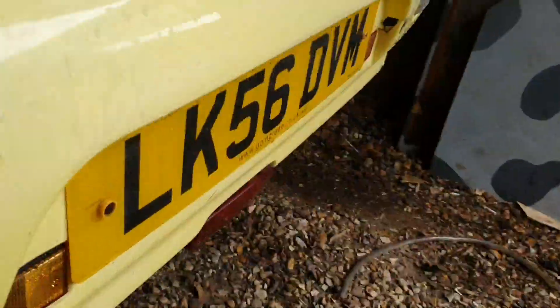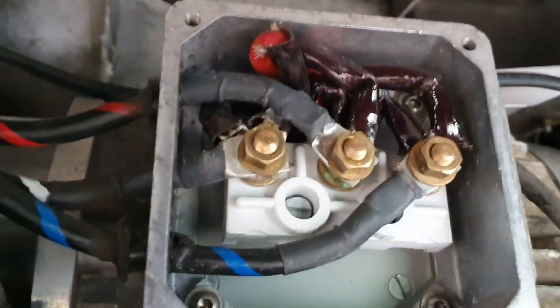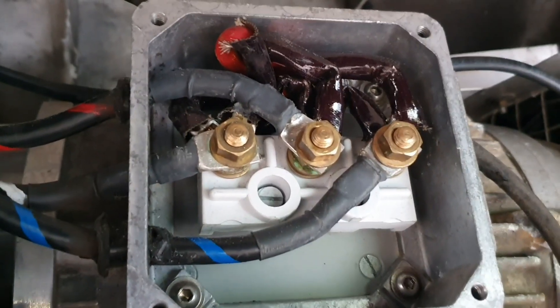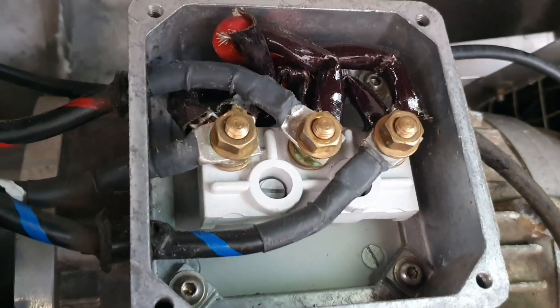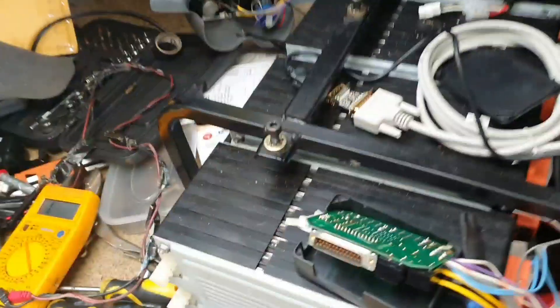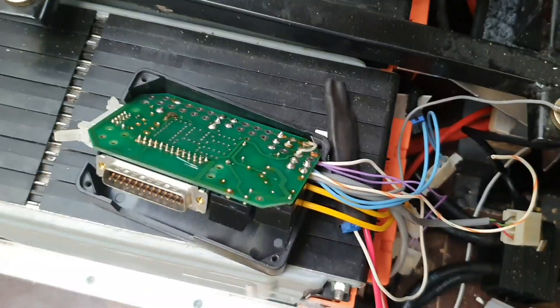The next step is coming around the back of the motor. You see where all these terminals are — the red little wires underneath. I've got to take one of each, check for continuity, and then connect those ones together separately onto a bolt. And what that will do is connect us into star.